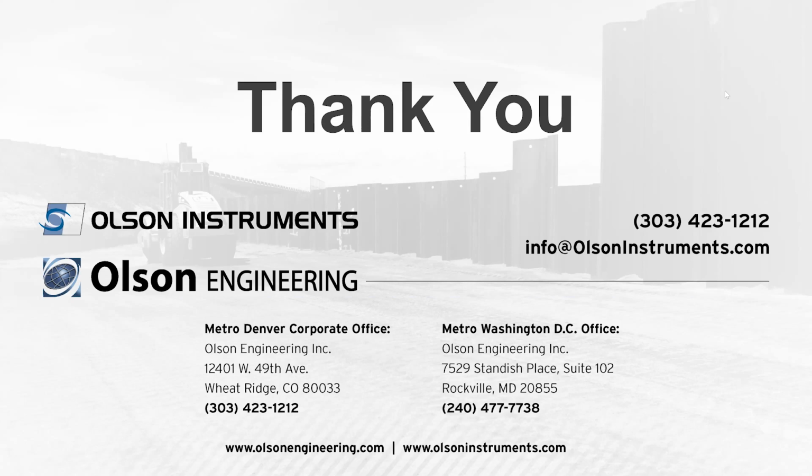Yeah, and the University of Maryland researchers decided to just make it simple and use the 12-inch plate in their follow-on study. But by measuring the force and measuring the displacement, as Pat indicated, either plate can work depending on the situation. Definitely, if it's softer, you should use the larger plate for sure. You have to do a standard sand replacement test to calibrate this equipment.